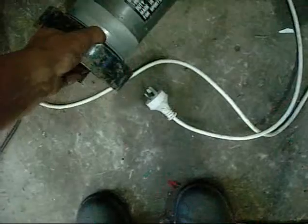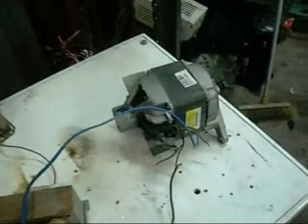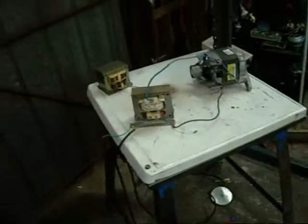Maybe that one — 180 volt, 1.8 horsepower treadmill motor. Alright, with the brushes from the dead one, let's try this old one again. Commutator bars are already starting to separate, there's a bit of a lump in the commutator. So I don't think this one will last very long.